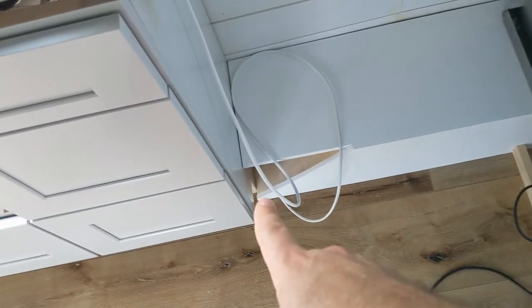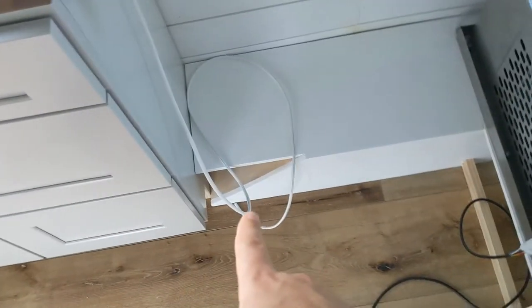And of course there's a little cubby right there that I made from the wheel well, which could be used, and our closet's going to go right here. I did the same thing. There's 3 screws there. I also had to, it's hard to see, but I screwed a piece of wood on either side, and then I also screwed it into the wall back that way.